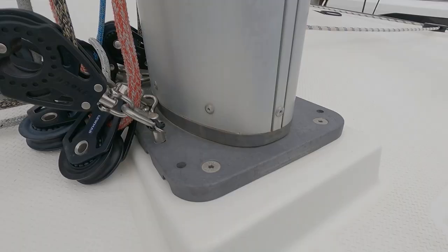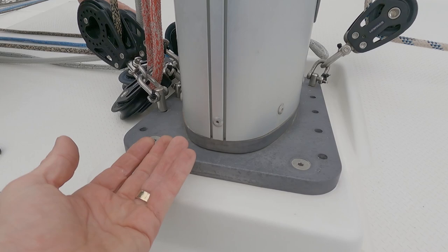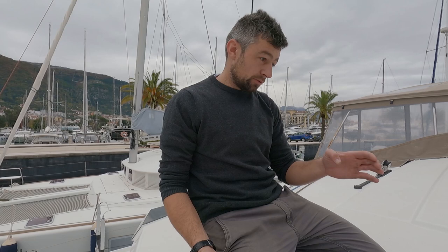When looking at a mast with a shoe on a pad, a cast aluminium pad attached to the mast sits on the mast base and gives some adjustment fore and aft for rake. The pad might not be completely flat — it's shaped to give the right rake so it sits properly. It's flat, but with the correct rake built in. This allows you to put some rake in the mast without putting undue load on the trailing edge of the mast profile.